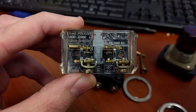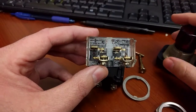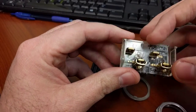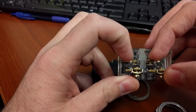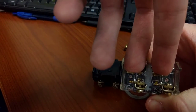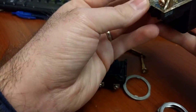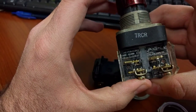Because if I'm doing a diagram, I'll label it 1, 2, or 3, 4 based upon it being normally open or normally closed. You can also see the IEC codes. But when things go bad, if I put an ohm meter across here, it should read zero because it should have 100% continuity through there. If I energize the switch with the ohm meter there, it should read overload or infinity. The opposite is true for the normally open contacts. Notice that these are not relay contacts in the sense that a coil actuates them — it requires a human to actuate them.